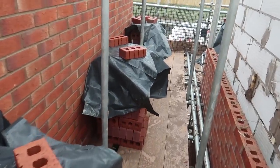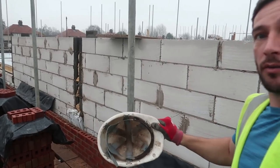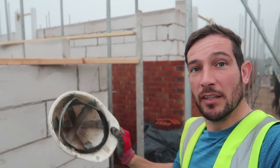Friday morning, we're all prepped to go on this gable. There was a lot of rain yesterday, so it's probably a good job that the silo mortar wasn't delivered in time. Hopefully it's been delivered this morning or else we're not gonna be able to start again. We've got all this back to do here. All the lintels are on, so we've got to put the soldier course on first and let them be going off. Then we're gonna jump onto the gable at the side and get that up. We've got all the profiles set up as well — Alan's set them up and put some supports at the top to stop them kicking over when we put the line on to pull it tight.